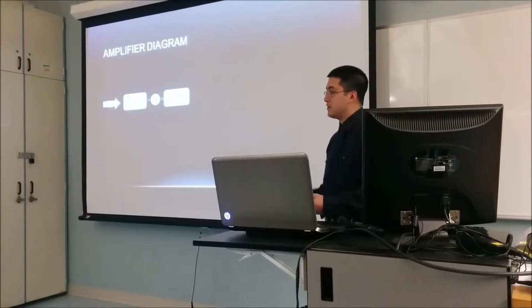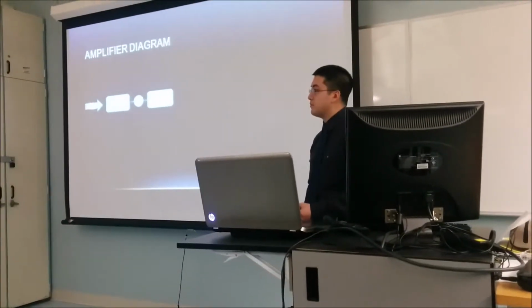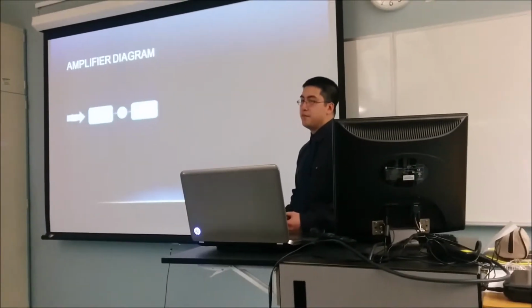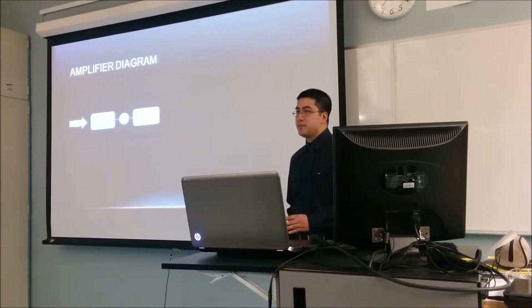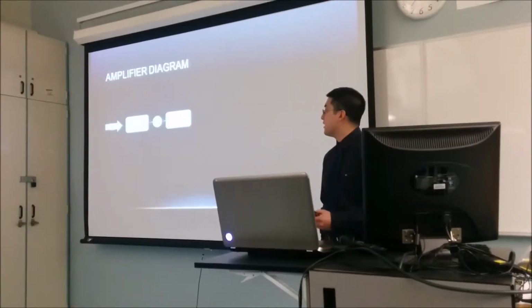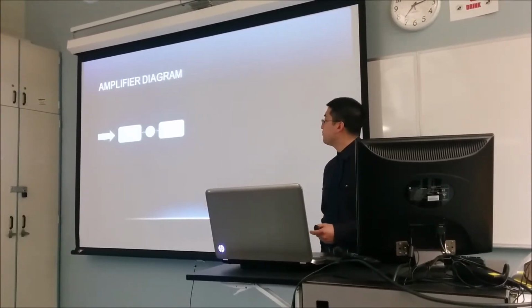We actually put his guitar on an oscilloscope, and we found that the output, just without anything connected, was up to, I believe, 1 volt peak to peak, and down as low as 50 millivolts. But generally, for average playing, it goes anywhere from 300 millivolts peak to peak to 600 millivolts. So we had to configure the first preamp to have an approximate gain of about 25 or so.